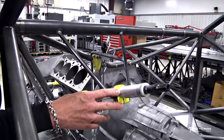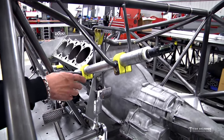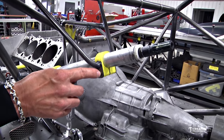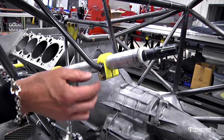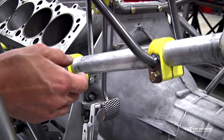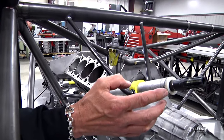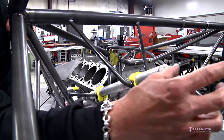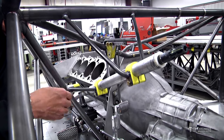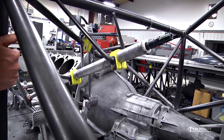And we've also incorporated the adjustable steering column mounts in this car. So we've got these taped up, but you can kind of see these two aluminum blocks are underneath of the tape. And the tabs that come with it have a three position hole in it. And what you can do is pull this bolt out and move that up and down either on both ends or at one end only, depending on where you want to end up. But it's really nice because it doesn't take much movement here to move the steering wheel a lot, because we've got steering column extension tube that's going to go on the back side of this. So one hole here will actually move the steering wheel about an inch on the end. So if you just wanted to go from one position to the next, you're going to gain an inch of travel back at the steering wheel.